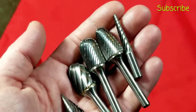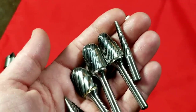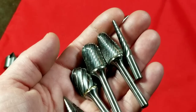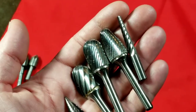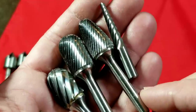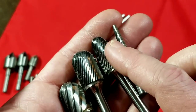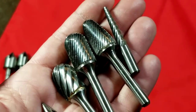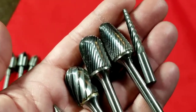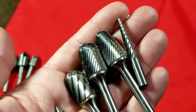I've been a little hit and miss using them on cast iron. Cast iron has a lot of very hard pockets due to its high carbon content — even though a piece of cast iron can be thrown on the ground and break, there are many pockets where the carbon forms very hard carbides and hard spots. So I generally don't recommend these rotary files on cast iron, as it tends to beat them up. Carbide is hard but brittle. On mild steel and brass, though, these work great. They do clog up on aluminum, but on mild steel they have a very aggressive removal rate.